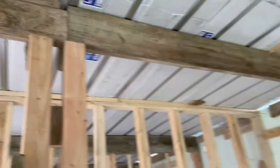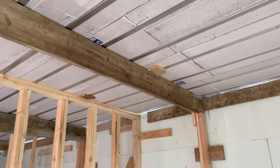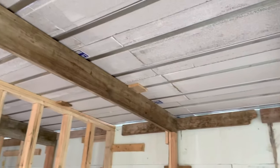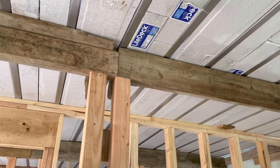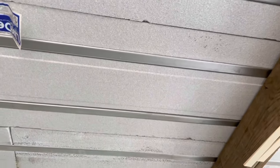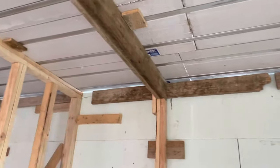I am counting on gravity to hold all this down. It's fine — I've got three tons of rebar up there now, and there's going to be almost another whole ton to go up there. So I'm just counting on rebar and gravity to hold all my forms in place while we pour. I did not choose to mechanically fasten them anywhere down here — none whatsoever. I just used those blocks so I could push to the south and get them tight.